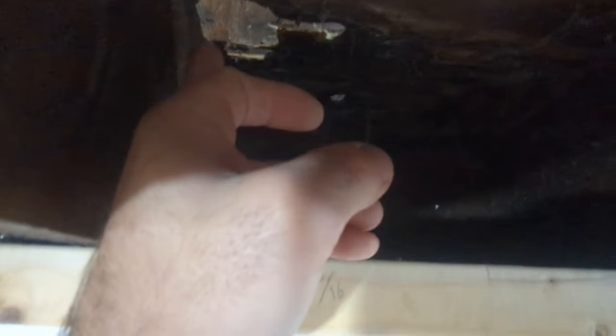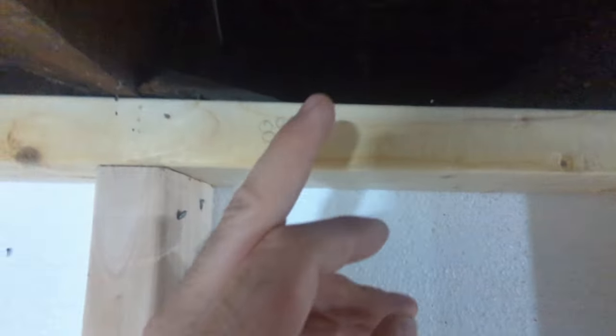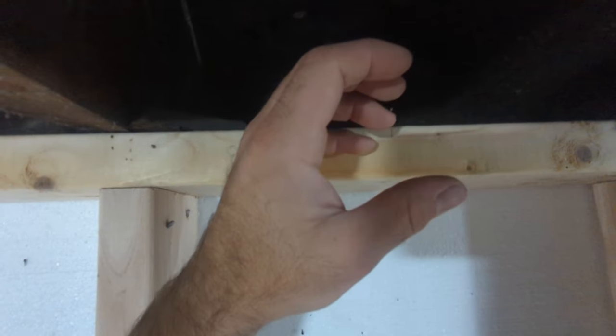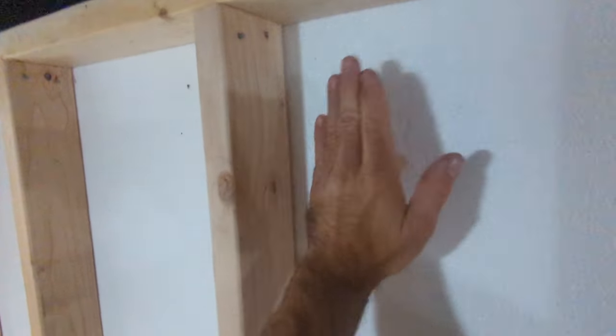So I'd like to think that if this is the location of a floor joist, there's a stud in the wall roundabout there. I'm going to go up and drill through the back of the cupboard. And then, based off of this position, I'll move over and plot up on the wall and drill. Then down here, I'll move over the same amount and reach over in there and drill up. And then I'll probably put an elbow on a piece of pipe that I feel will get us down into this space. And then put the other elbow on it here. And then we'll roll in here, and then we'll roll down into the wall.